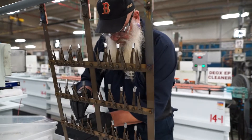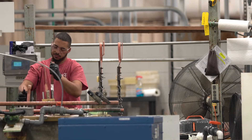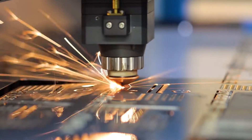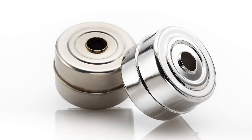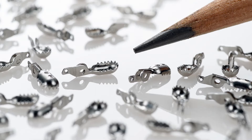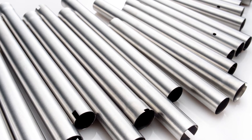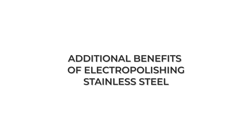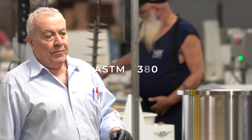The chromium in stainless steel forms a thin, oxygen-enriched passive layer on the surface of the metal. This layer is what makes stainless steel resistant to corrosion. Manufacturing processes such as machining, cutting, stamping, and welding will disrupt the passive layer and embed free iron and impurities into the surface layer of the metal. These impurities lead to corrosion if left untreated. Depending on the needs of the client, New England Electropolishing typically recommends using electropolishing to achieve passivation, which provides greater corrosion resistance than nitric or citric acid passivation while also enhancing the part's micro finish and producing an aesthetically pleasing finish. Passivated parts are compliant with ASTM B912, ASTM A967, and ASTM A380.